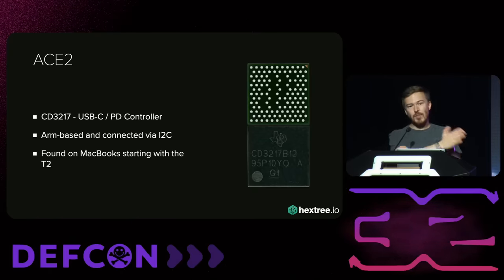Eventually I got success. I managed to get into app mode on the ACE3. By checking the version number, I can actually see I was successful — I changed it to version 42 and we glitched the ACE3. But the problem is we only changed the external patches, and we don't actually know what these patches patch because we don't know the actual ROM. Essentially we have this flash full of random functions, but we don't know what they do, how to trigger them, or whether they'll actually be executed. And even if we execute them, we don't have any input or output.